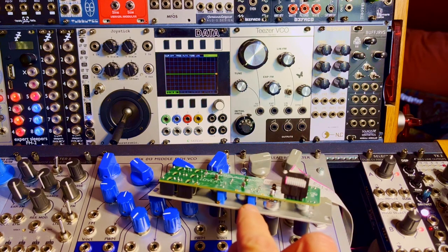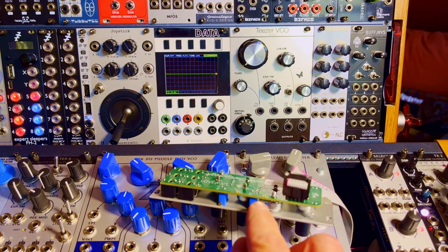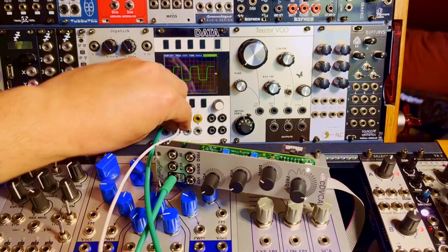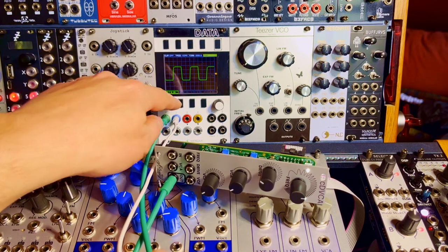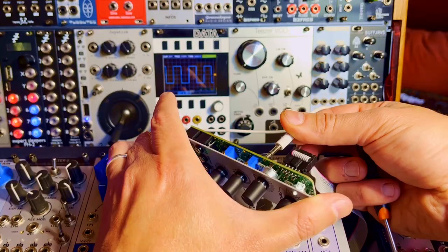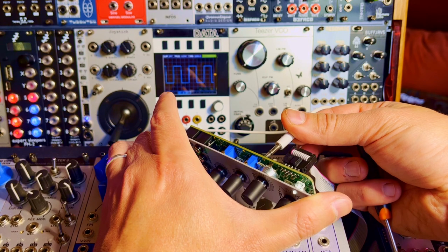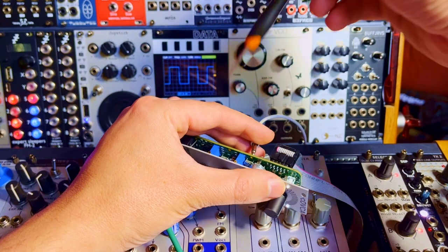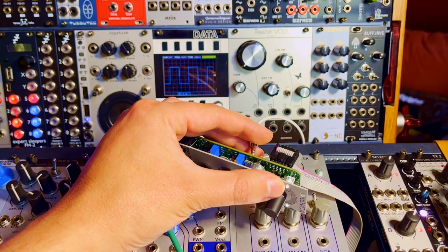We need to use test point two on the back of the PCB. Let's take the output right here — we've already connected ground via the sleeve of the jack. Enable channel two. This is looking like pretty square — pretty much 50% duty cycle there, and that's what we want. Wider on top, narrower on the bottom. Looks about right. Maybe a multimeter in duty cycle mode would be even more accurate, but I think this is probably good enough. We don't have to go crazy with this — it'll sound great just as it is.